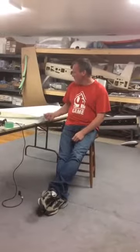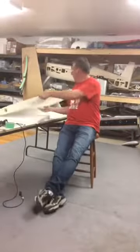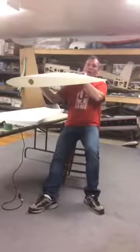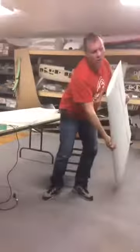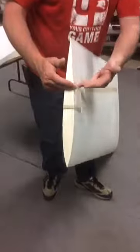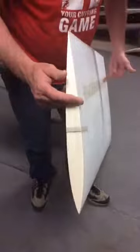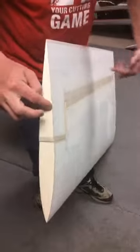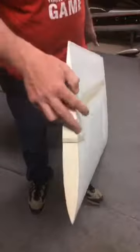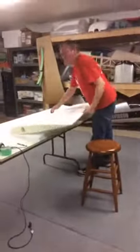Again, just to review, make sure to mark the end of your end caps where that straight leading line goes. Here's the marks on this end cap. When I want to cut this off once it's sheeted, I just throw a straight bar from this mark to the end mark. Then I can draw my straight line and cut perfectly down the center. I'll show you. All my bars are out in the other shop. Again, we'll try and show some of this over the weekend.